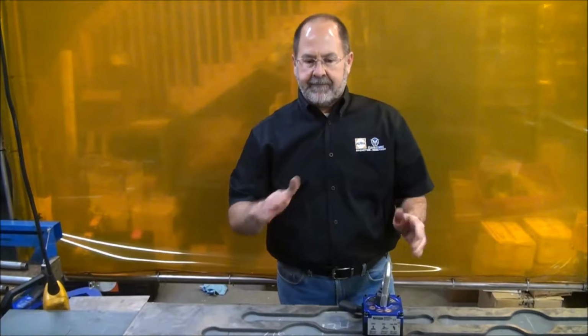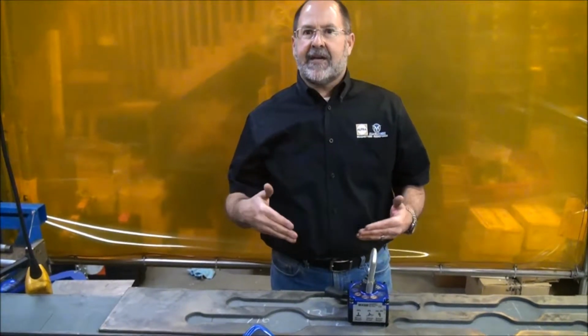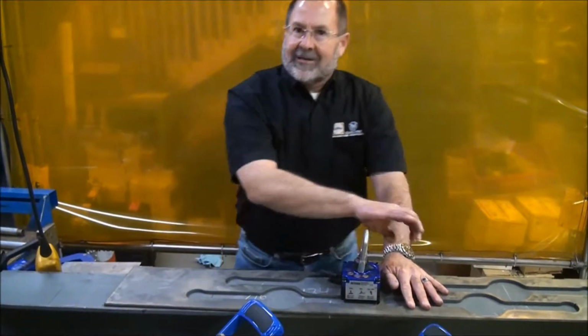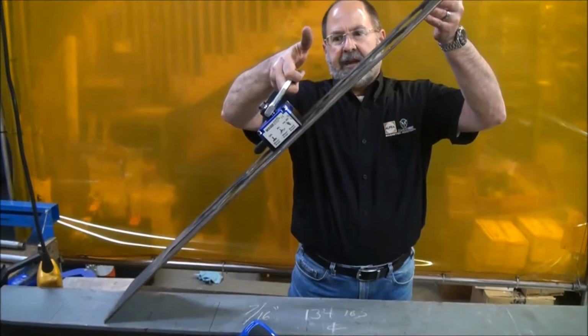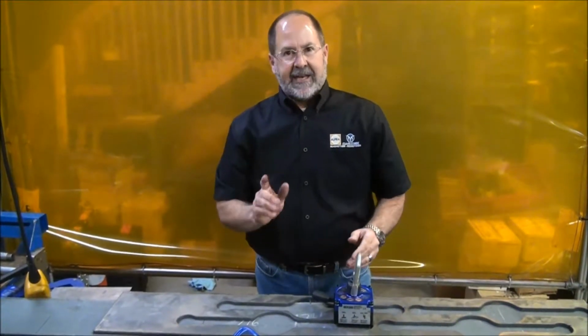You've got to pick the piece of steel up, whatever you're trying to pick up, in a vertical direction where the steel is always horizontal to the floor. Anything else puts a different type of force on the magnet. Our magnets happen to be the best in the industry when it comes to shear force, as we call it, or sliding, which is what you're doing when you're picking up a piece of steel in a vertical direction. You're creating a shear force. But you've probably not calculated for that lift in shear. That's the reason why a test lift is critical.